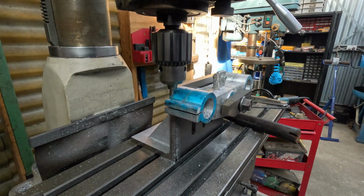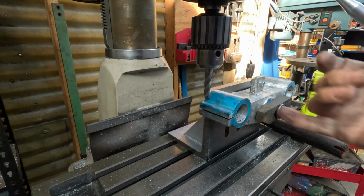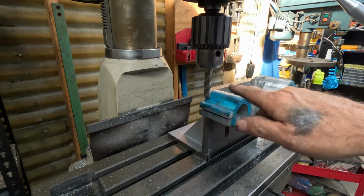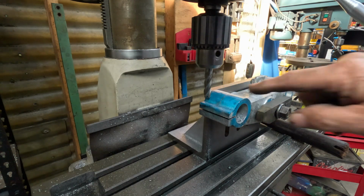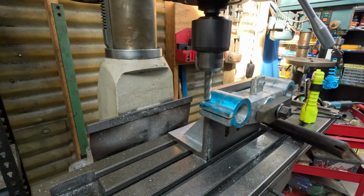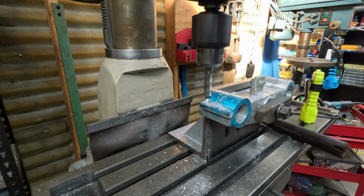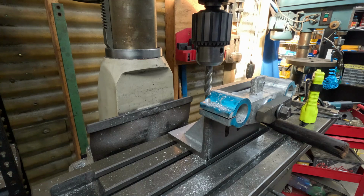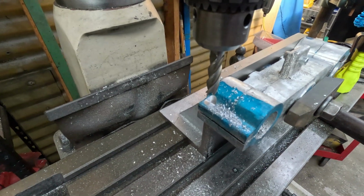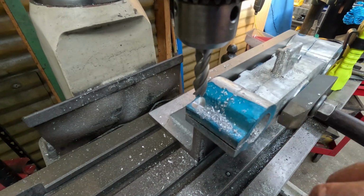Oh, not fast enough, got to change the speed. So I've got my end mill in. Now most times you use a 2-fluted slot drill because it'll cut the center out, but this one's actually set up to be like a slot drill as well. So that's why you wonder why I've got a uni mill in, that's why. And that's exactly what I wanted. I'll try and bring the camera in. I can't bring it too close because it doesn't really focus, and it's probably out of focus now. But I'll change back to a center drill in here now, and then start drilling all my holes.